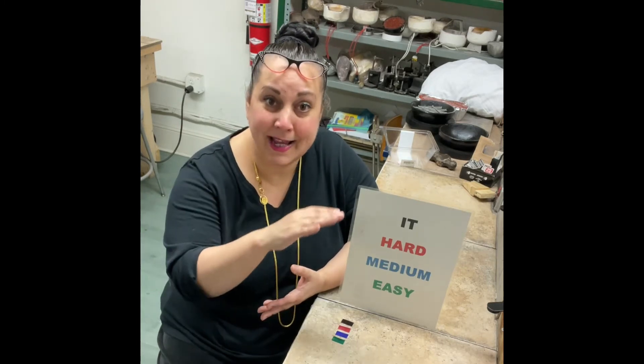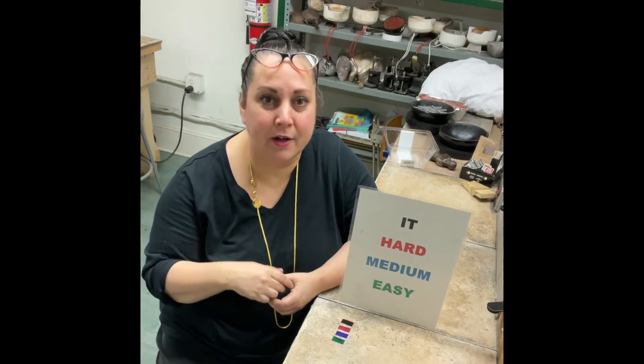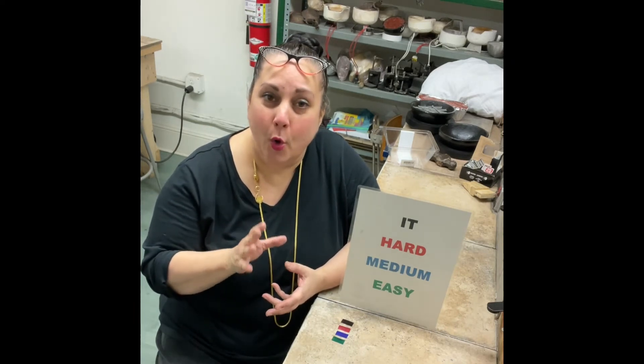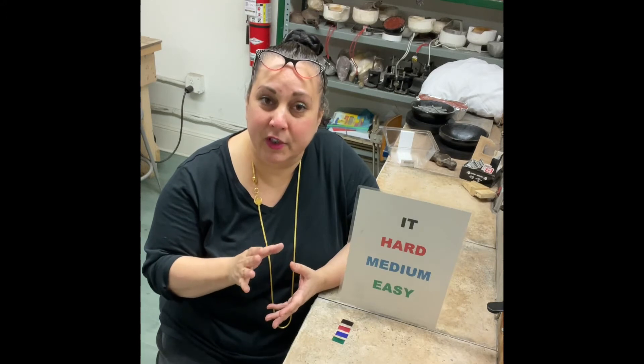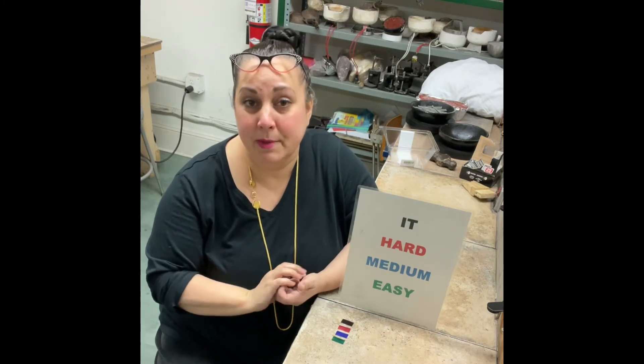In silver, you take silver and add things like copper to make it melt at a lower temperature — that's how they formulate all the solder. Same thing with gold: they take gold and add metals with a lower melting point, and that's how you get 22-carat solder, 20-carat, 18, 14, and so on. The more stuff they add to make it melt at a lower temperature, the more opportunity there is for things to get a little funky — and basically that's what happens with easy.